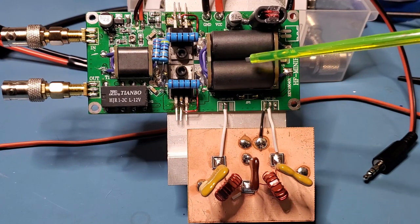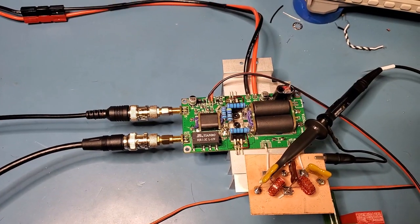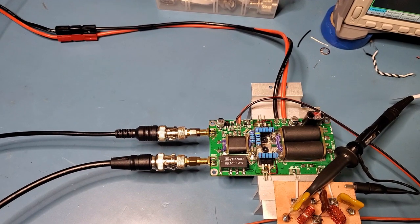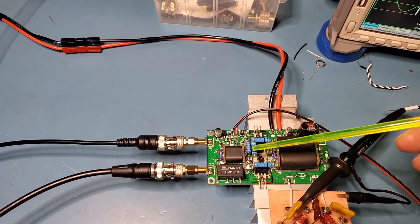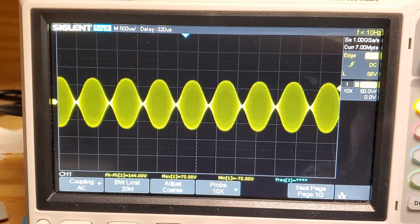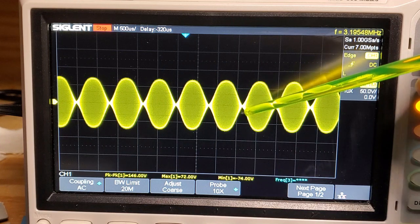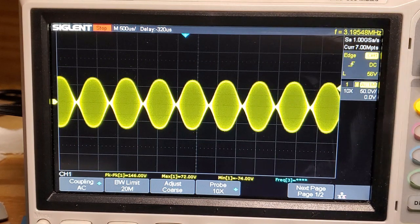Before I go, I'll show the effect of having these two resistors on the output side of the input transformer — effectively 15 ohms in parallel. Let's have a look at the oscilloscope trace from that. You can see we now have distortion at the crossover point — it sort of comes down rather than with a clean crossover; we've got that distortion going on there.